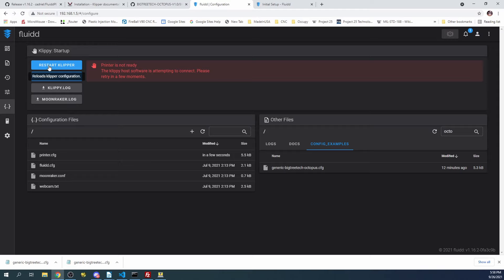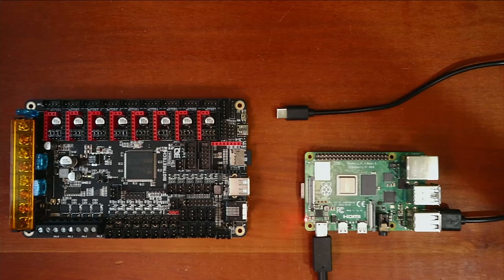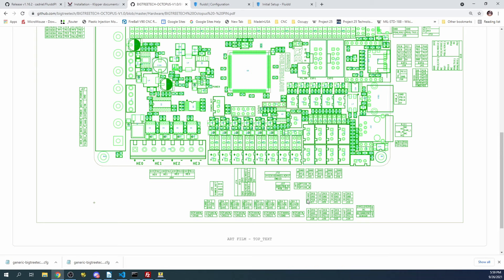There's still an issue connecting - it's saying it's shutting down because there's not a correct configuration. We'll go over to the workbench and power down the board. We have to connect a few things just to make this work on the benchtop. On the computer, I'll go to BigTreeTech to find where our thermistors are. TB is the bed thermistor and T0 is the hotend - we've got to connect two things there. We also need the end stops: diag zero is probably X, diag one and diag two.